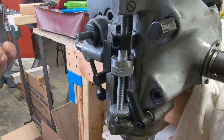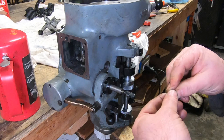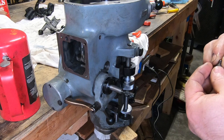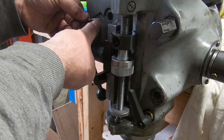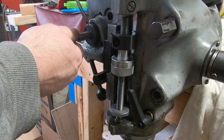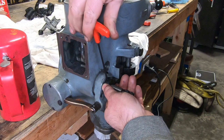I'm going to install this feed reverse knob now — it'll make some of the rest of this a little bit easier. There's this very tiny steel ball that thankfully I didn't lose during the disassembly, that goes in next followed by a spring and a cap — this rides in a detent. I want to make sure I don't make that spring too tight, so I'm testing the three different positions for that detent before I tighten up the set screw on the collar.